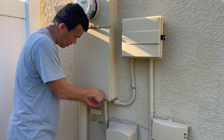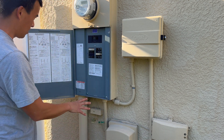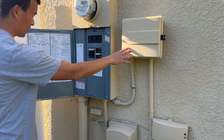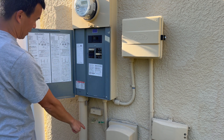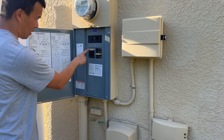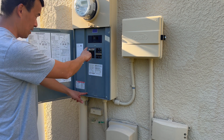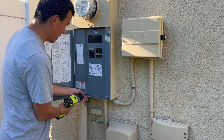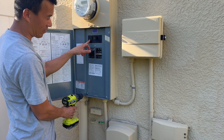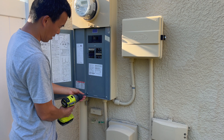The customer accessible panel is right here — you just lift this up, push this thing back so you can drop the panel a little and it swings open. In my panel I've got my stove, my air handler, the irrigation 20-amp service, other outlets on 20-amp service, and my pool pump on a 30-amp. Right now I don't really have any room, so I'm going to double-tap my air handler 50-amp right here because this new surge protector requires 50 amps. If you guys aren't comfortable working in a panel like this, I really suggest hiring a professional. At minimum, turn off the main power into the house. I work on this stuff all the time, so I'm going to try to be very careful and go ahead and open it with it hot.